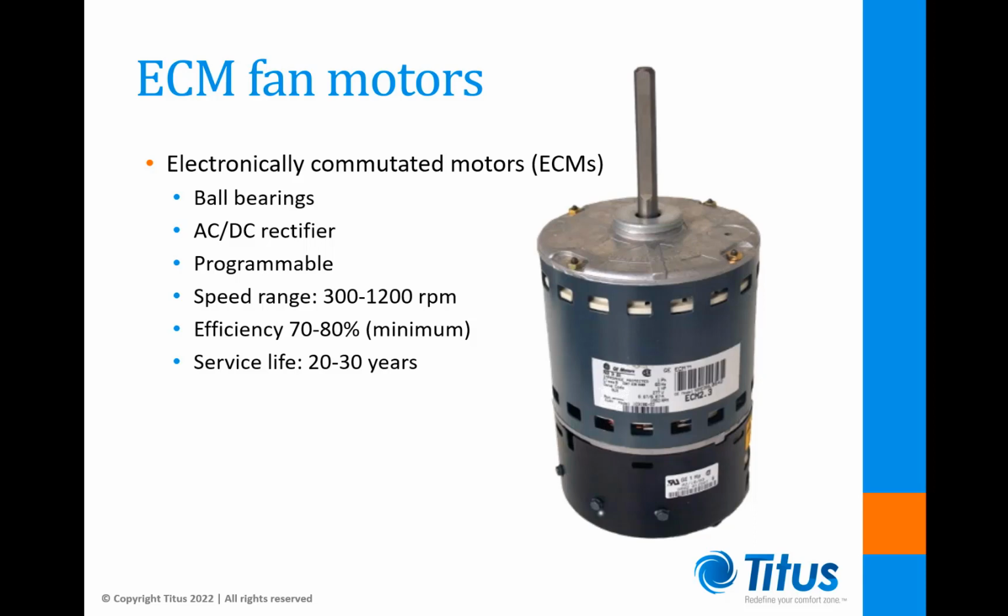ECMs have none of the problems of PSC motors. Speeds can be adjusted between programmed minimum and maximum fan curves. The ball bearings have no minimum speed limit, and the PWM speed controls don't create any power distortion. Something very important to note is that ECM efficiency actually increases as speeds are reduced, and efficiencies of over 90% are easily achieved. Energy codes are impacting which motors must be used in various applications.